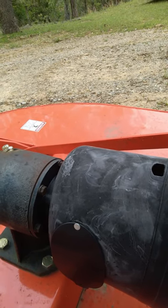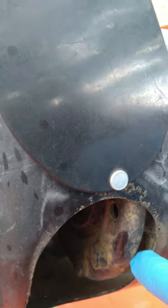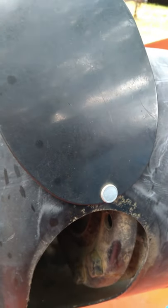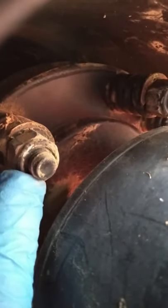It'll cost you thousands of dollars to fix if you don't keep up with this. So under this cover, you can see this is actually the clutch. There's a plate on each side, and these bolts go through, and there are springs on the other side — the discs are actually sandwiched in between there. You put a wrench on the back, on the bolt on the back, and then take a socket. There are eight bolts on this one, and you loosen these nuts two revolutions on this model, the 1260.